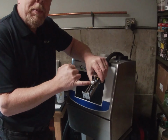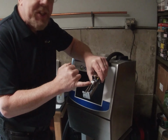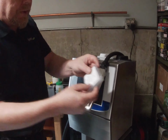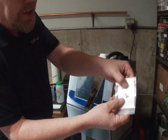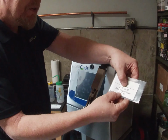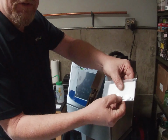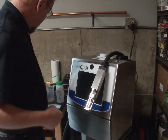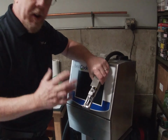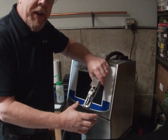But for the process, you definitely need a replacement O-ring, the little rubber seal that goes at the back of this. So here's the rubber seal. You can get a pack of 10 of these, part number 210001-08, and they're a little boot, little rubber seal that goes in the back of the nozzle plate. And then obviously a beaker to collect all the waste ink when we're flushing through, okay?